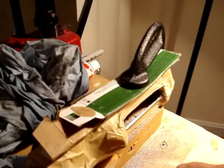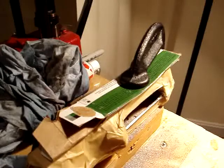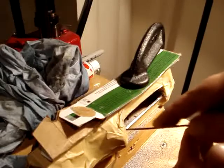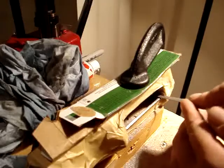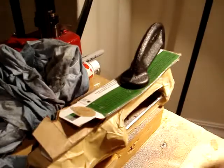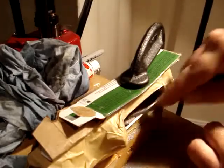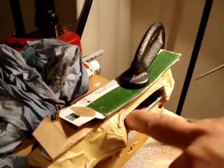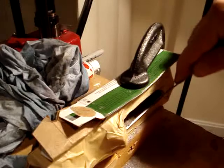Before, I actually tried using files, and they are doing a pretty darn good finishing job. With the round file, I fixed the round parts of the gate a little bit here and here. And with this flat file, I used it to flatten and make it a little bit smoother, which is really nice.